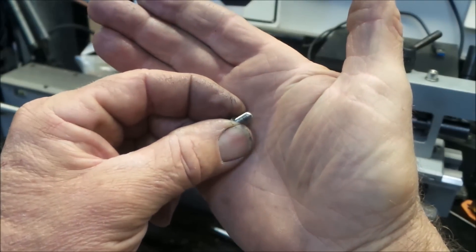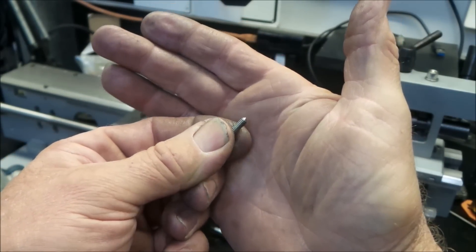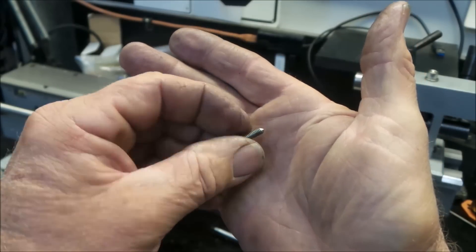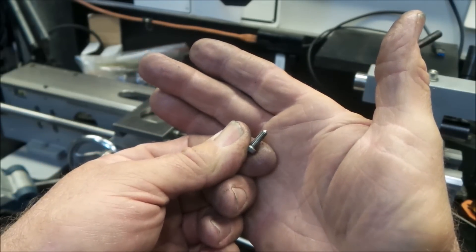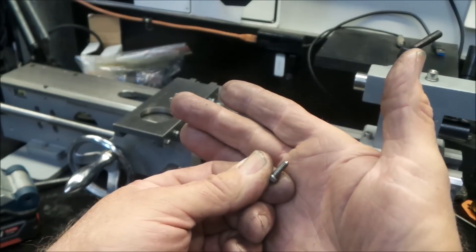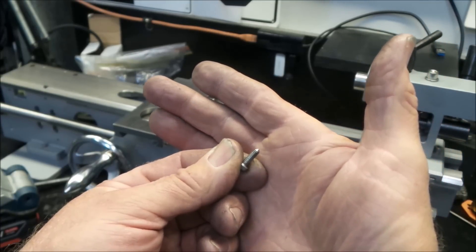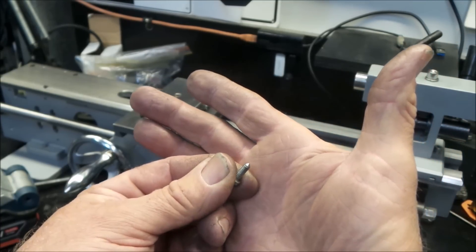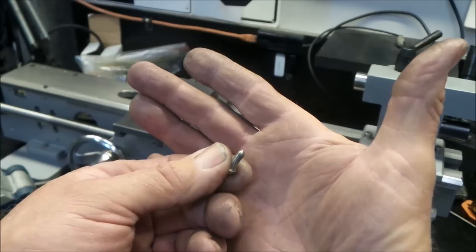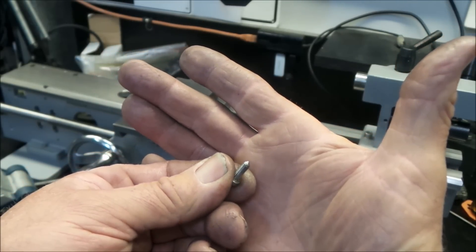The end of this screw has a little bit of a point on it — just cleaned up with a rough point. The way I do that is: first cut the screw down to the right size, then mount it in a cordless drill with a nut on it to center it, and run it on the belt sander. I'll cut the other one down and give you a demonstration of the technique I use to create even points on things that are fairly hard to hold on to.